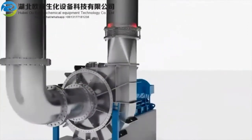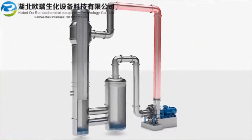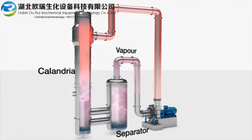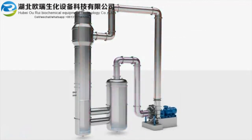The reheated vapor can then be fed back into the calandria to provide the heat energy required to evaporate more feed liquid as it passes down the tubes. The mechanical vapor compression process is a highly energy efficient and cost-effective way of retaining and reusing the latent heat contained in the vapor — energy that would otherwise be wasted. Once the process has been started and brought up to temperature, the only energy input required is the electricity to drive the Exvel turbo.